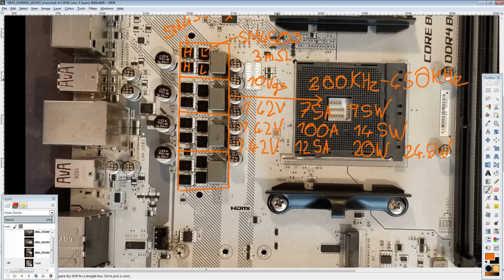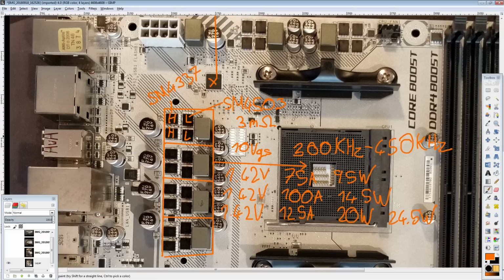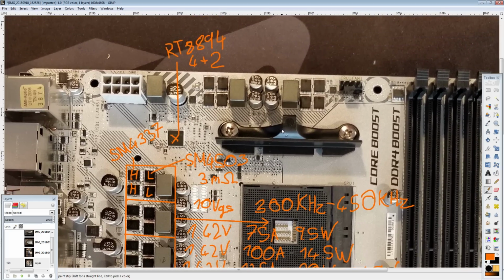Yeah, if you're not going to be using Precision Boost Overdrive, then this VRM is really solid. And hey, if MSI manages to fix their Precision Boost Overdrive implementation, then this would still be really solid. And arguably, I wouldn't run Precision Boost Overdrive on a lot of the competition's boards, because even if they have a better implementation, those boards might overheat. If you max out PBO and give yourself a minus 100 millivolt offset, a lot of the other boards might still overheat because their VRMs are garbage and their heatsinks more so. So yeah, MSI has lots of potential here with the hardware. If they have a good BIOS implementation, this could be a really solid board.